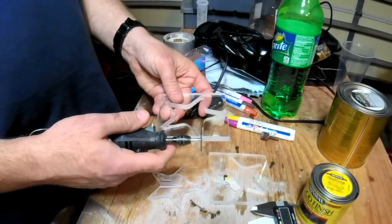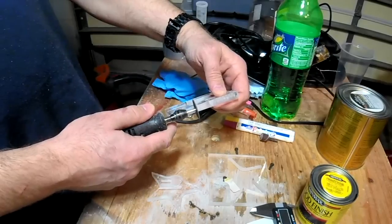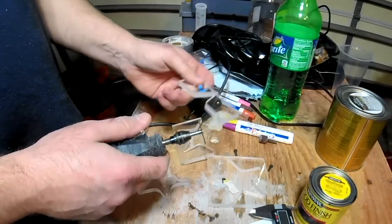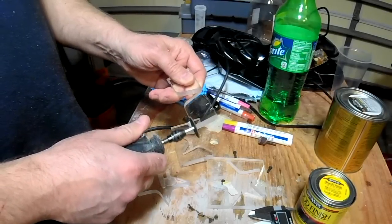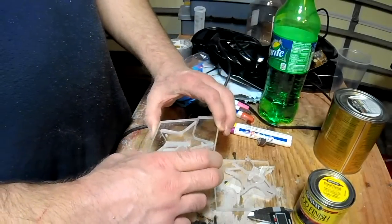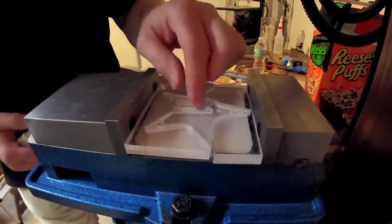But after that was done, instead of attaching it with glue or something, what I wanted to do was use screws. I used 8-32 machine screws — they were low head screws — so I put a countersink in it so they wouldn't stick out. Here I'm making a little jig for it, made out of what I cut out of it. It worked well enough for my purposes.